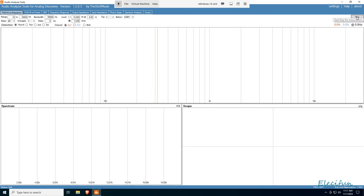Now, it says it can go up to minus 55, which means you could use a 35 volt output transformer, two lots of 35 volt AC, and that will get you 50 volts, something like that. But if you go up to 40 volts, trying to get your 55, it's actually going to go to like 56 and a half.